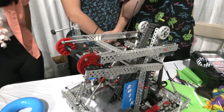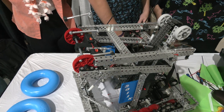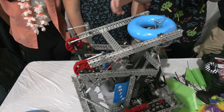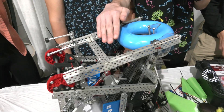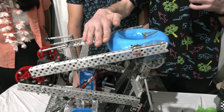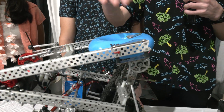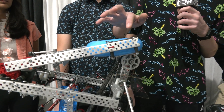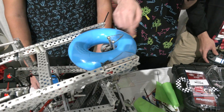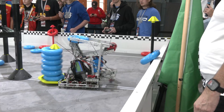For the Wall Stake mechanism, we run it at 40 RPM with a 12-to-60-tooth gear ratio. We have our Wall Stake mechanism — a Lady Brown mechanism, designed by Team 18522R. It raises up, we intake a ring into the Wall Stake mechanism, and it's kept in place by horizontal and vertical friction using anti-slip material and two pieces of Lexan. Since it's at 40 RPM, it can efficiently score on the Wall Stakes.